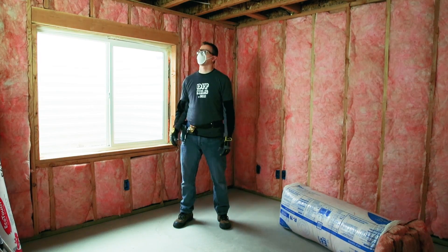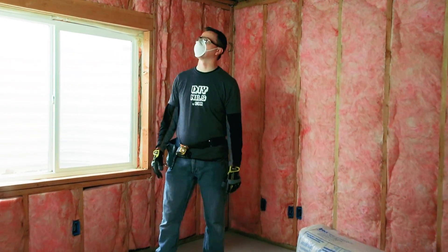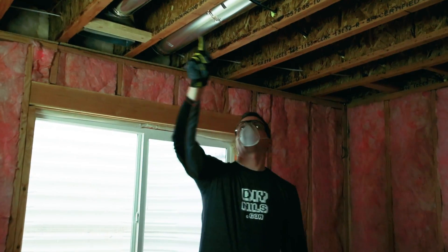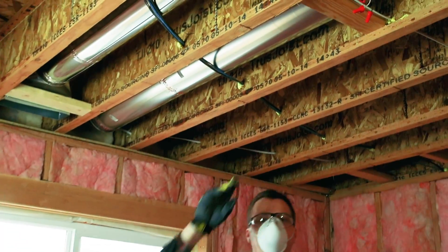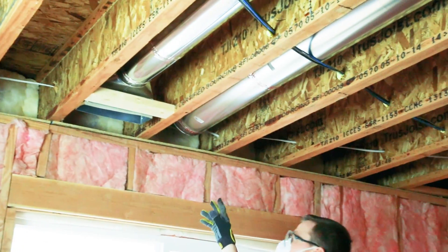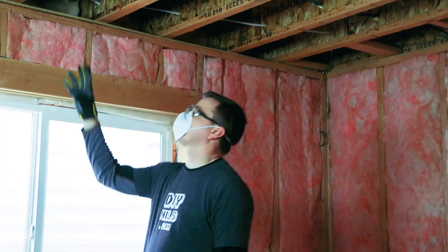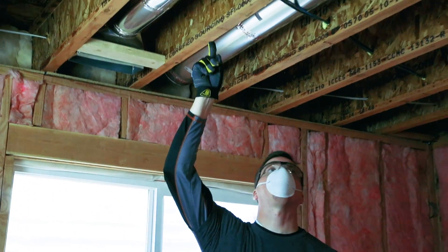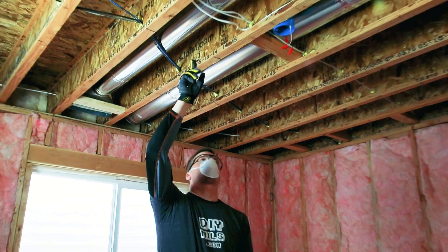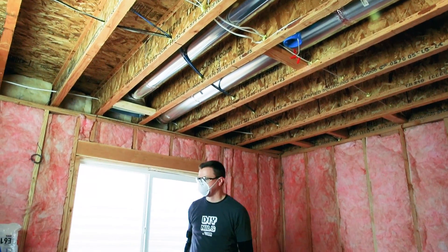Once you have your walls done, we're ready to take care of the ceilings. The ceilings are actually quite a bit more complicated than the walls because you've got a lot more to deal with: HVAC runs, wires crossing all over the place, gas lines, water lines, and soffits. So there are lots of different obstructions to keep in mind as you're insulating around all of these different systems. I'm going to start with a fairly complicated one — I've got a line to my register, audio-video cables, electrical cables, and some studs.